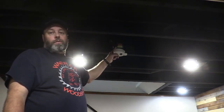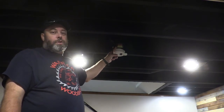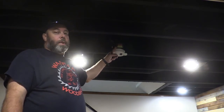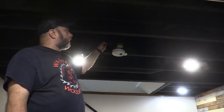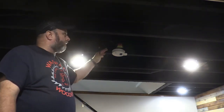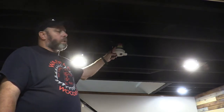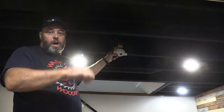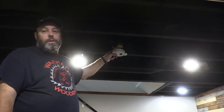If you don't have one of these transformers already installed, it's a little frustrating but not impossible — the wire to the left goes upstairs to the door chime, and the wire to the right goes outside to the doorbell. Honestly, if you don't have one installed I would look at a wireless system. But if you do have one installed at the correct voltage, you're good to go. If it's not the correct voltage, these are about $25 to $30 at the local home center.